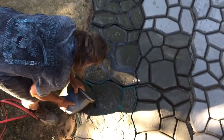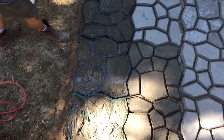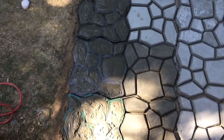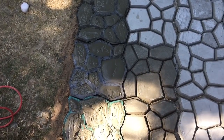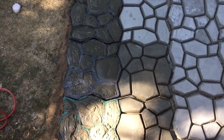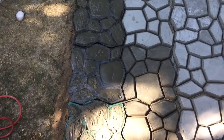While pouring, let's talk about the problems we had. First, we tried to get too many bricks — almost 12 bricks the first time. They were real thin and wanted to break up. Another problem was when we pulled the form off, some came apart and it was sticky, which ruined the bricks. That was caused by not having clean forms — they were oiled well, but we didn't get all the old concrete off.